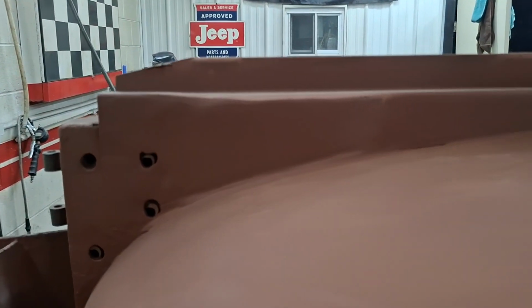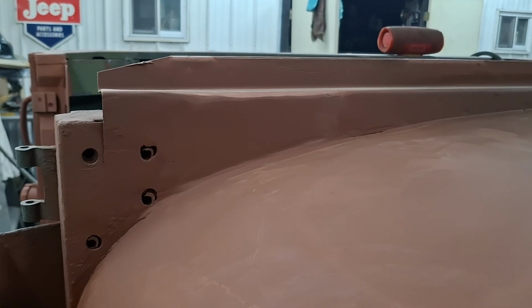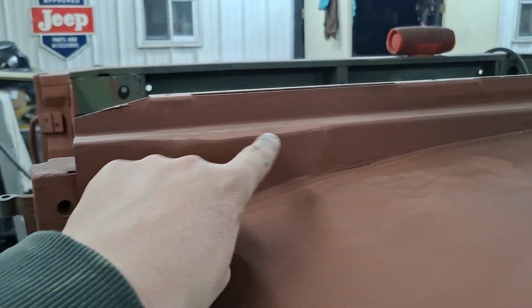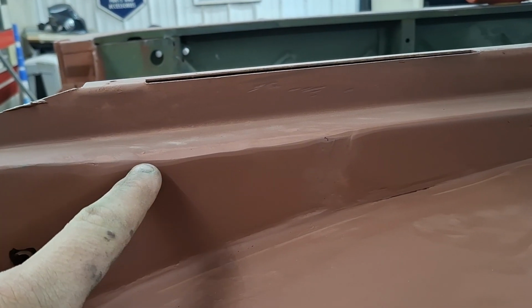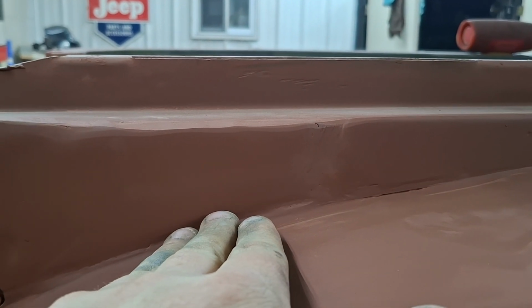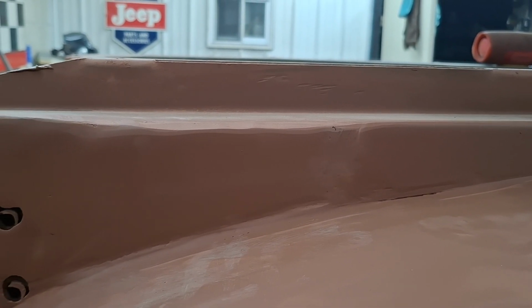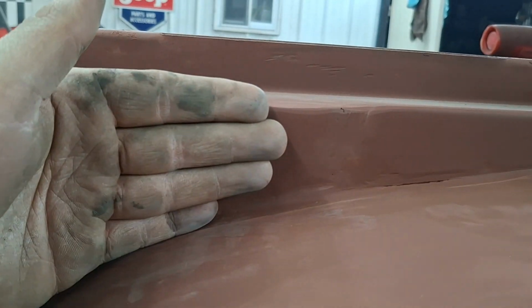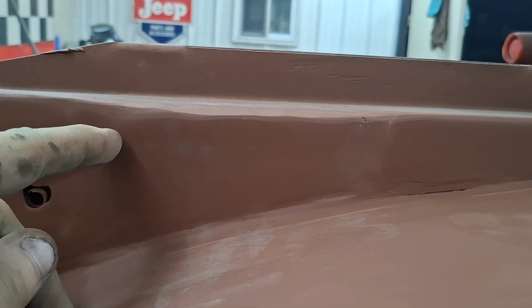Repairs finished up. I don't think I even talked about it video-wise, but repair-wise, I just cut a whole bunch out. I fixed the defrost vent, which comes down and over. Fixed that first, and then a piece of steel, 1/8 inch, across and curved, bent to it. All that in place, and then this vertical piece went down, welded it across, and then I ran out of gas with the MIG, but I still kept going.